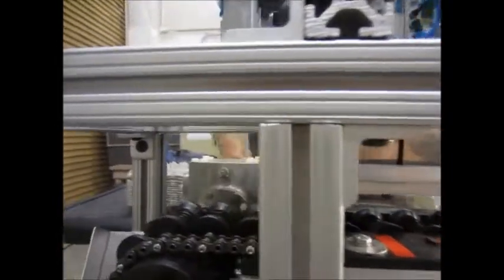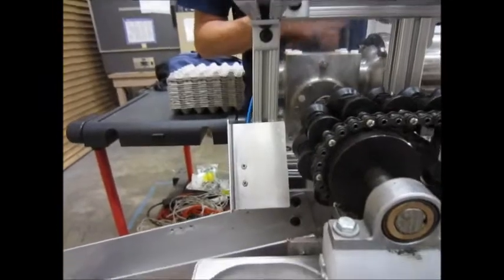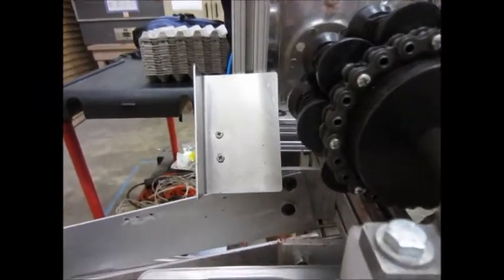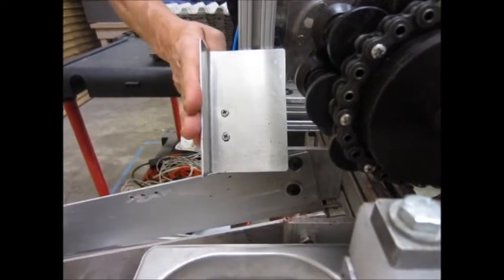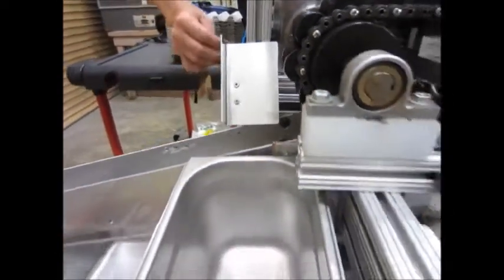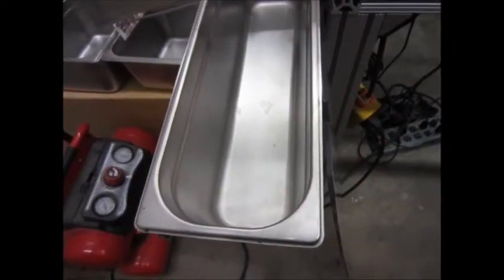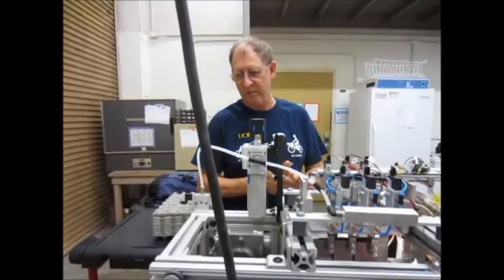The blade slices the berry so as to preserve the greatest amount of red and get rid of the green. If, for some reason, the berry is not oriented correctly, or perhaps the color is not right and it's not quite ripe enough, the berry will pass through the blades without being cut, and this paddle will come out and eject the berry as it drops off the end. That berry can then be recycled to try again, or it can go straight to a juicing machine.